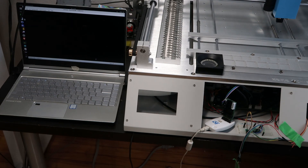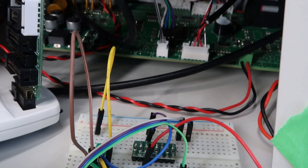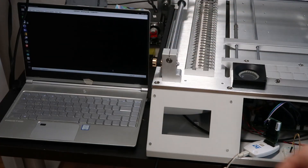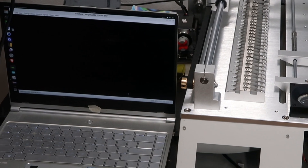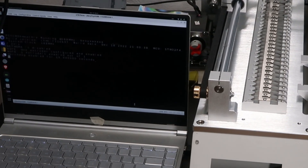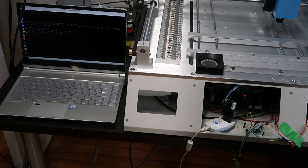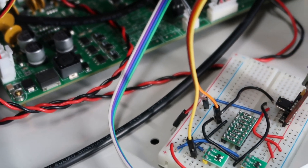This here is just a basic breadboard inverter using a MOSFET — keep an eye on that screen as I turn it on. Wowza — actual decent output. Awesome. It turns out that the RX and TX are both inverted, so I doubled up my little circuit and cleaned up the breadboard, and now we have comms.